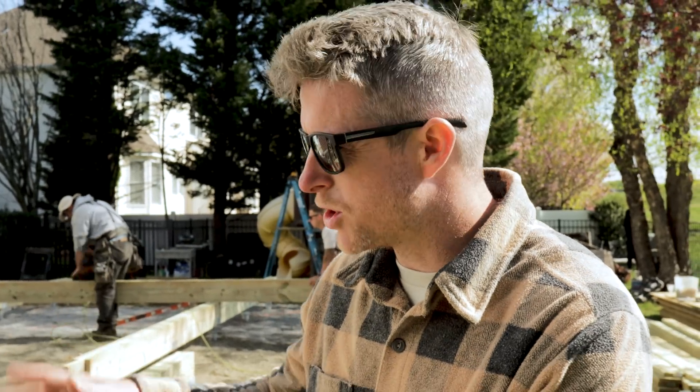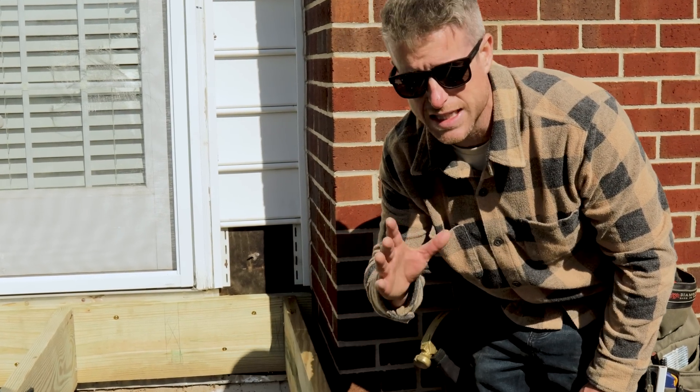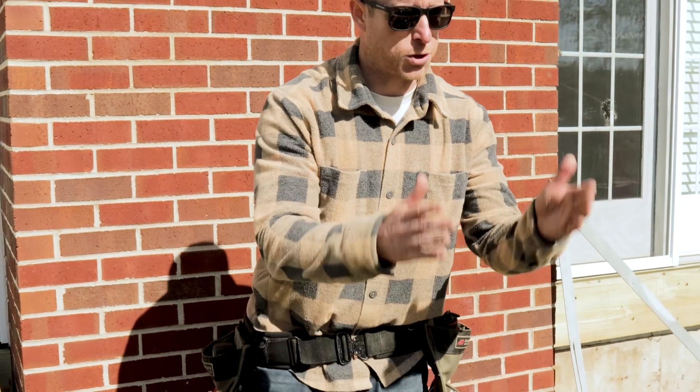Now we've got our beams and everything leveled and nailed up, we are ready to start installing our joists, and this part goes super quick. But we have a nice little detail going around this fireplace — we don't want to structurally attach to it. So on this side of the fireplace we'll have a double joist that'll essentially act as a beam, same thing on the other side, and then we'll put hangers across here, double two-by-ten, about an inch away from the fireplace. That's going to act as our structural support as we bring the joist out in front of the fireplace. Attaching to brick can always be really tricky — this is a good way to get around that, not structurally attached to it.